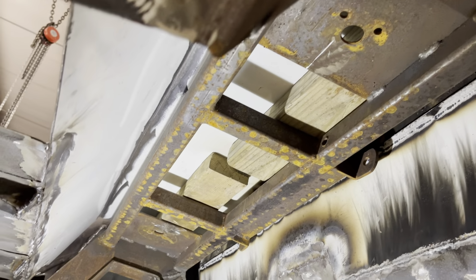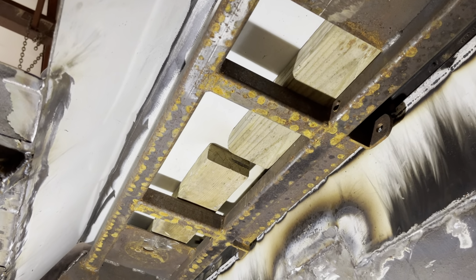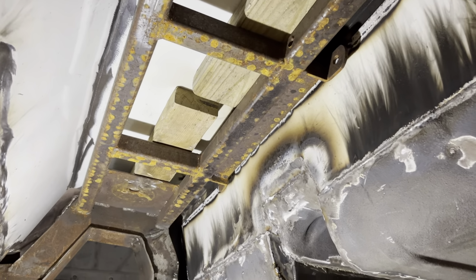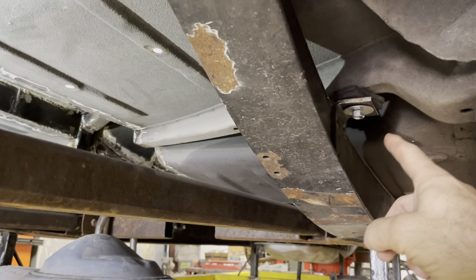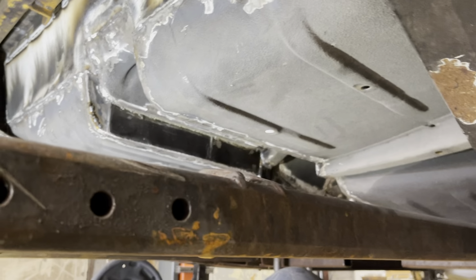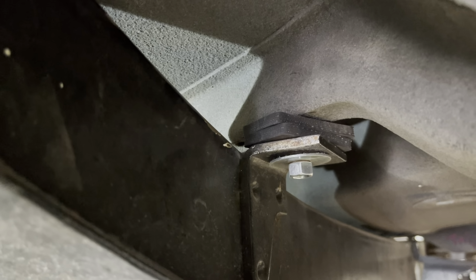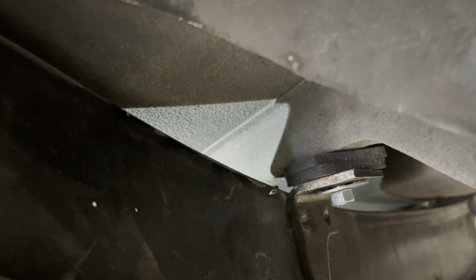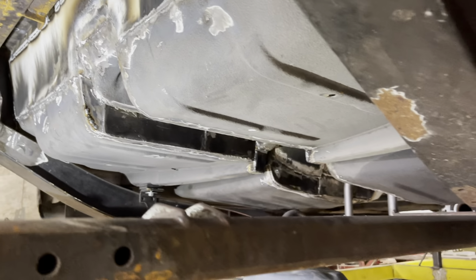Now you see the 2x4s in there. Those 2x4s are lodged in there. I cannot remove them, but I'm about to remove the body, or at least loosen the body here from these body mounts, and remove it an inch or so to allow only one pad. Only one pad is utilized on the car. I confirmed that with Chevys of the 40s, and I'm going to go ahead and raise the body up and put one pad on all the mounts,